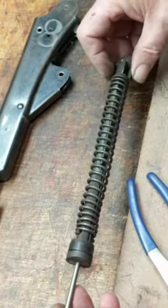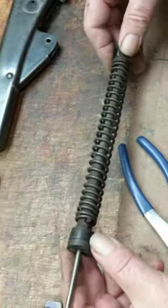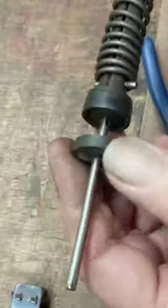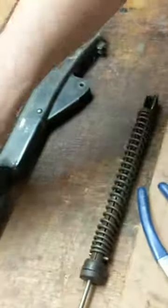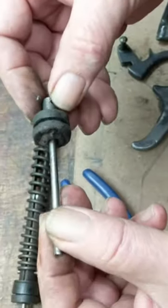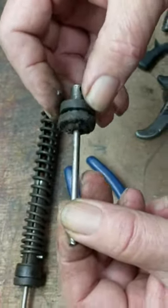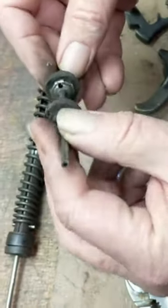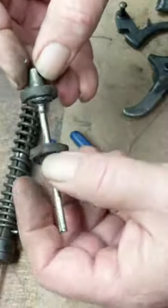In this particular case, it came out of the gun with plastic seals on this end of the assembly. Normally, you would find on a gun of this vintage leather seals and a slightly different plunger. You'll see that the compression seal is leather, the abutment seal is leather, and the compression tube — or air tube itself — is a piece of machined steel.